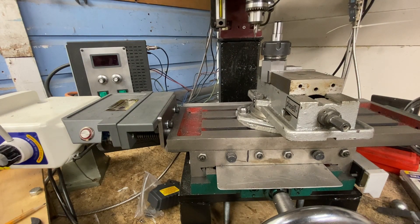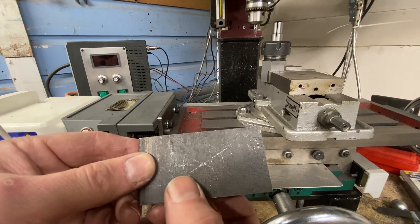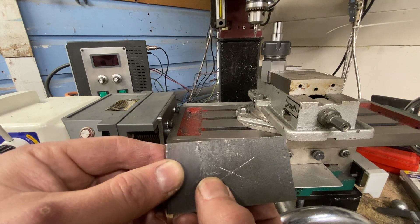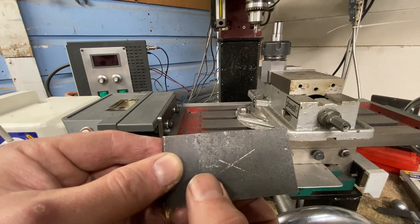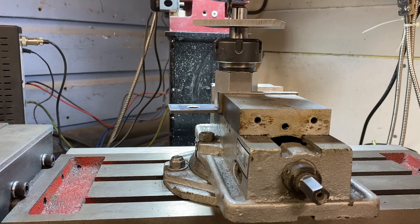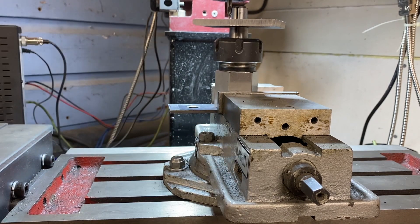To line everything up it's really pretty simple. I laid out a pattern on this piece of steel — there's a hole center punched and then I did a radius that was going to be the center of my quarter inch holes that need to be drilled, and then I center punched that spot. Once I get this mocked up in the collet block I will line up this small center punch, and from there it's just a matter of rotating the block for each hole. I've got it set up so that it's up against the edge of the vise, so each time I reset I know that it is in the correct spot.